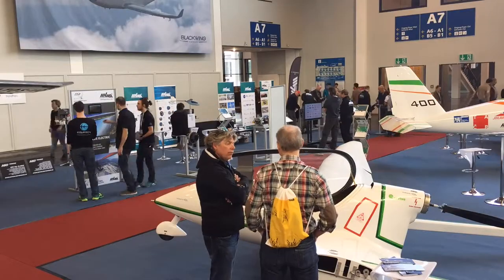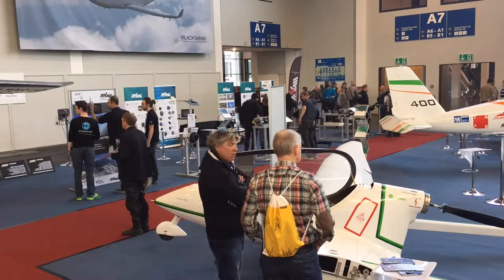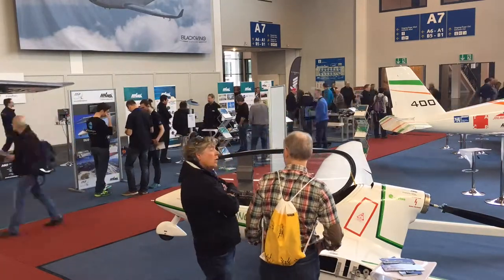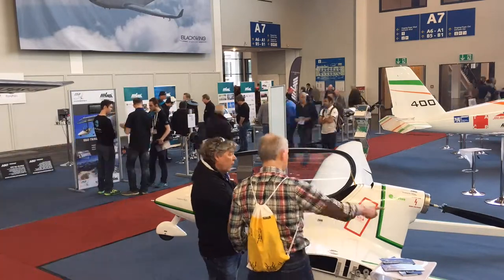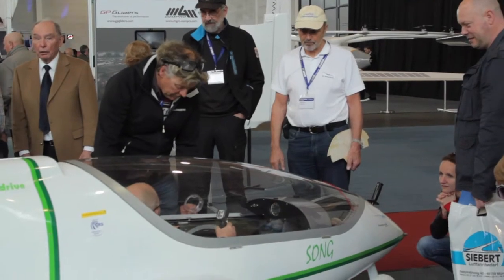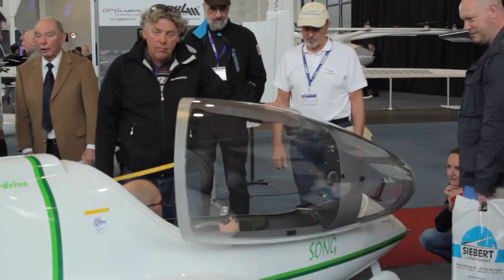What's the feeling of the customers? As we both know, the aircraft is equipped with an electric motor from Rotex Electric, which can go up to 25 kilowatts at max, but it runs somewhere up to 20 normally. It's equipped with the MGM Compro controller HBC 280-120 and with MGM BMS and Charger. So we have a complex electric unit.